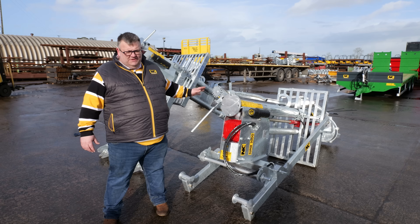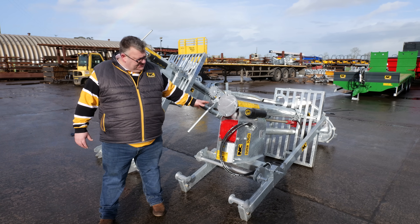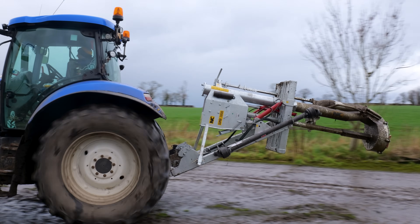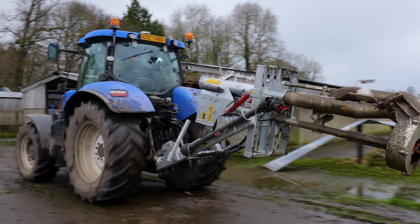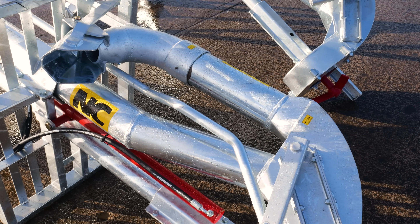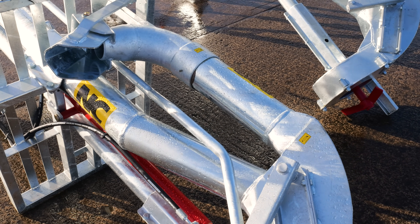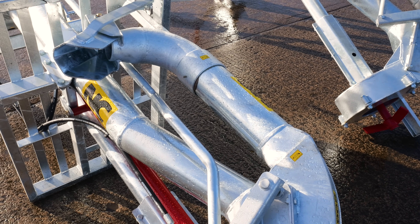This is the lay down version — same performance, 3000 gallons per minute or 13,500 litres. PTO shaft at 540, hooks onto your two-point linkage. You put your bar at the back of your tractor, reverse in, lift it up, it clicks in, and your arm rests against the underside of your arms and off you go. It's hydraulically controlled for depth — you put it in your tank, as you slide it out it goes over centre, tips up vertically and drops down into your tank, and then you can adjust the pump up and down on your cylinder for the depth of the tank.